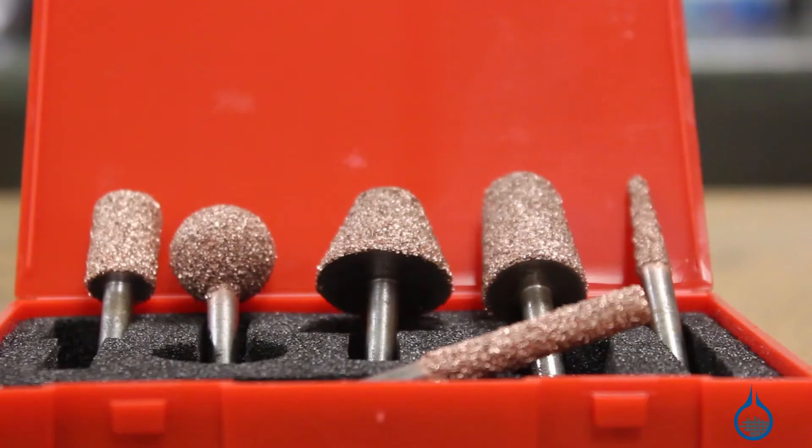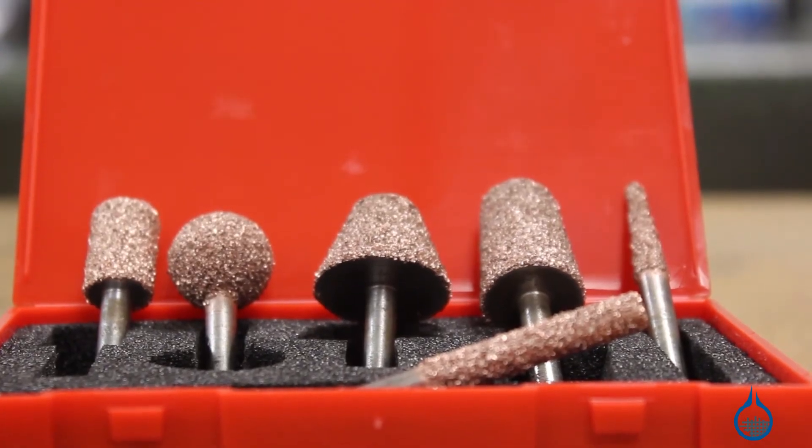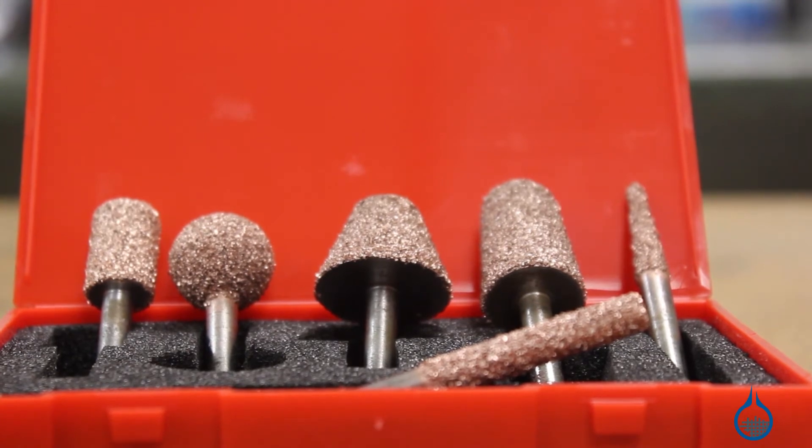Our number 1920 is a complete six-piece kit that gives you everything you need for cutting and finishing the edges of your laminate. These bits don't break or lose their edge easily. They feature a 6mm shaft and are compatible with handheld or table-mounted routers found in manufacturing environments. They do not get clogged or loaded easily, and they have a long life.